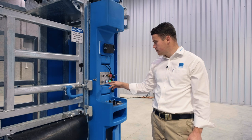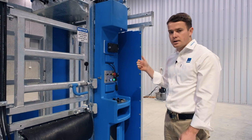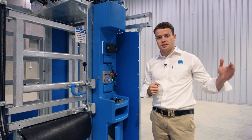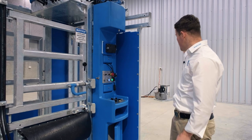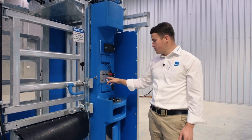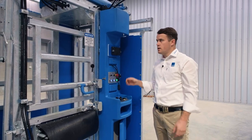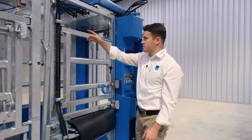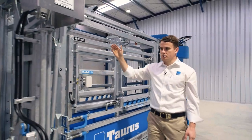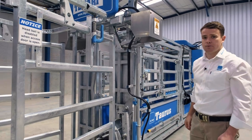So if we press auto now — in this mode you'll have the remote control to operate an additional hydraulic gate back in the race. This allows the operator to be standing back in the race and control a race gate one section back so there's always one animal ready to walk into the crush. When we press the auto catch button, this will open the head bale based on the width that we've set. As the animal comes in there's a sensor up here which will close the entry gate, and as it moves further forward there's an additional sensor at the head bale and one at the front which activates the closing of the head bale door.